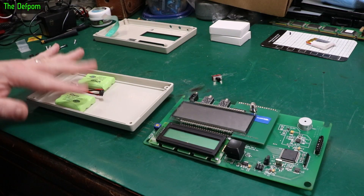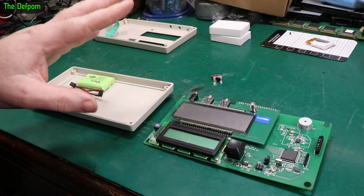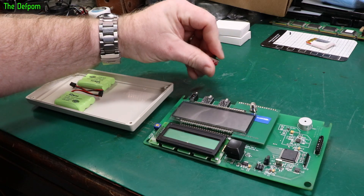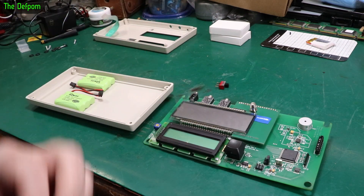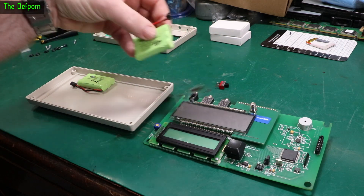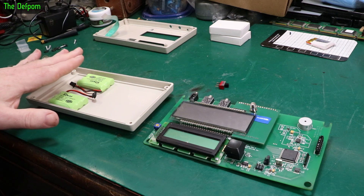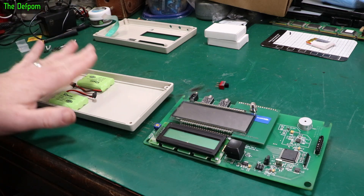So that's about a week later. Batteries have arrived and I'm just planning out exactly how I'm going to modify this. My current thinking is to get this thing running off batteries — I need to add a switch, which I've got here. I'm going to use this slide switch because it's very much like the original ones that come in these units, so people will be used to it. I've got these two batteries here which are 3.6 volt, 1250 mAh apparently. These will fit inside the casing — AAs won't fit, these are AAAs. I could potentially fit four of them in there, but I think two will be enough. I'm going to do some testing on it and see how it works out.